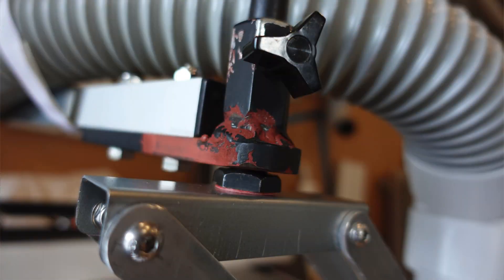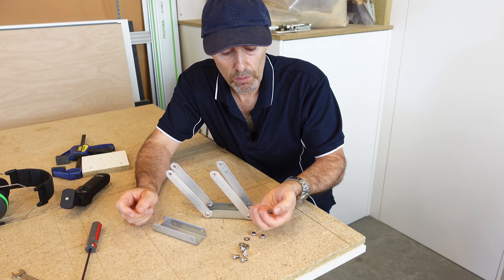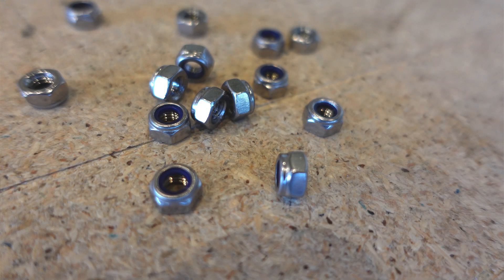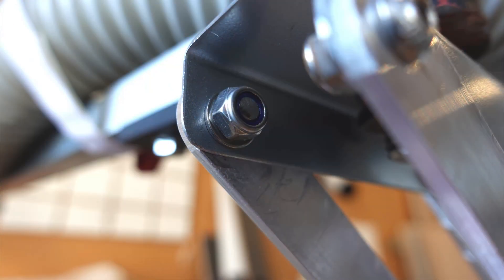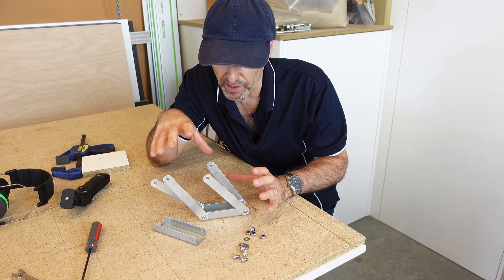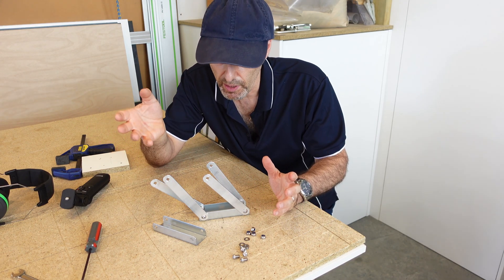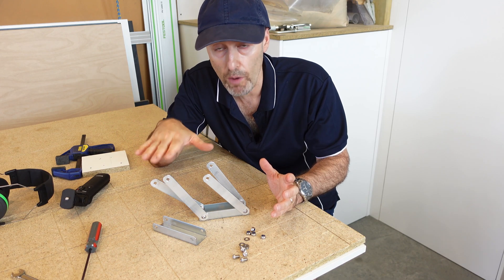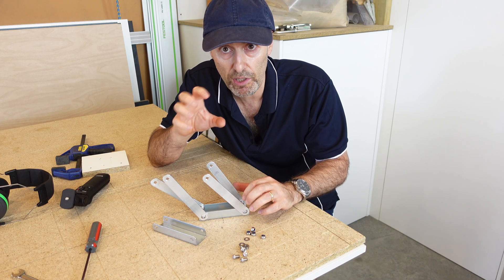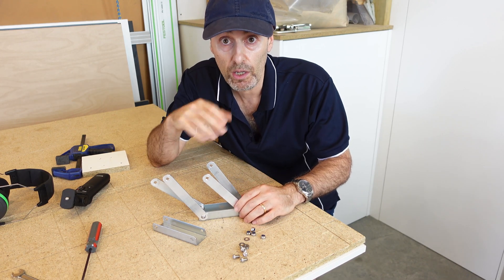This one here has the hole to accommodate the bolt that's going through. My pro tip here is to make sure that you're using lock nuts. I've just nipped these up so that they're just snug and tight. You can also tighten that up or just nip it up when it's all together and see how it goes up and down, to see if it actually stays in position. If it does start to drop or move, it's a matter of tightening these lock nuts just a little bit, one by one, to get it so it moves and stays where you want it to stay.